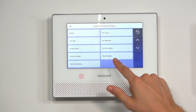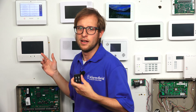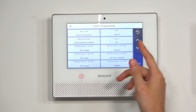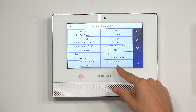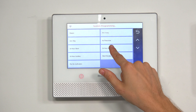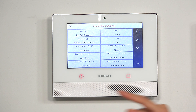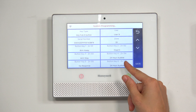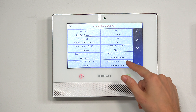Now, I'm going to set button four back to a 24-hour audible just to demonstrate the single-button input. Normally, to meet SIA guidelines, you wouldn't use this fourth button with the panic function — you would leave it set to something that won't trigger an alarm. But for our example, we'll keep it that way. Following SIA guidelines, you would actually set button six to the panic button and make it 24-hour audible. There is also a fifth button, and we're going to set that to no response since we're not using it. Now, button six is zone number 136 — it's important to remember that, because we're going to go in and manually change zone 136 to a different loop number.